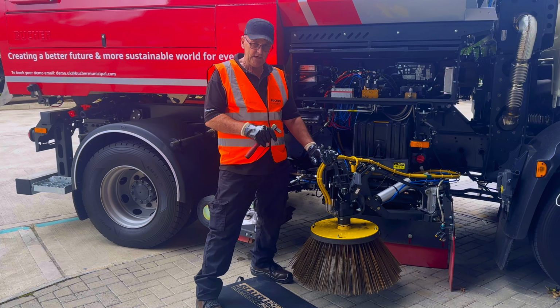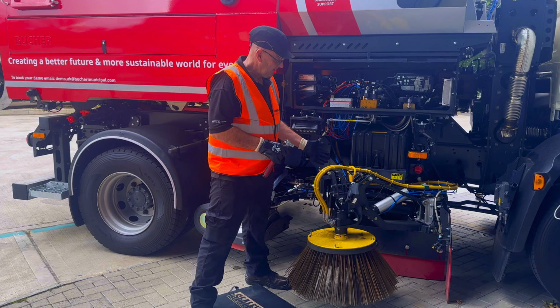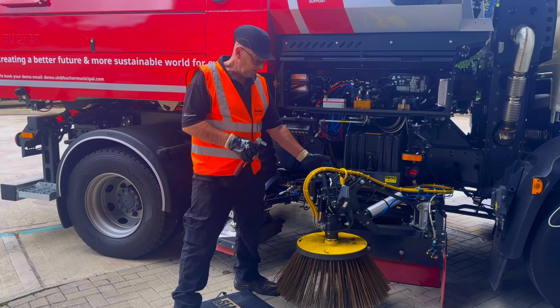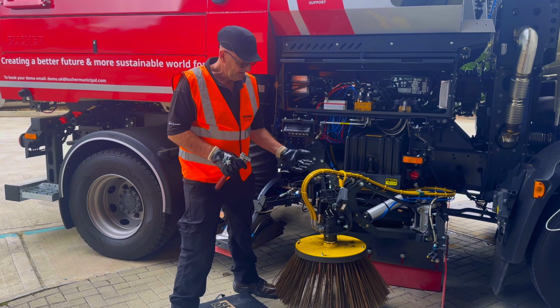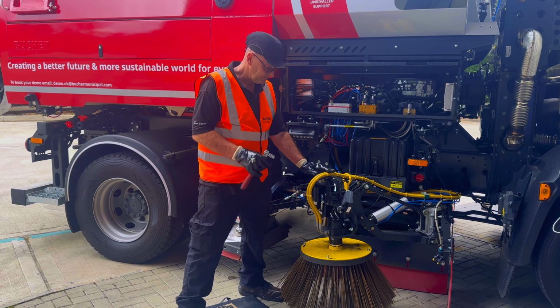Now we're going to look at changing our channel brush. What we've done is just put the vehicle into brush service mode, which relaxes the hydraulics on the channel brush, and it allows us to pull the brush arm out. Keeps it suspended, which makes it easier to actually remove the brush.